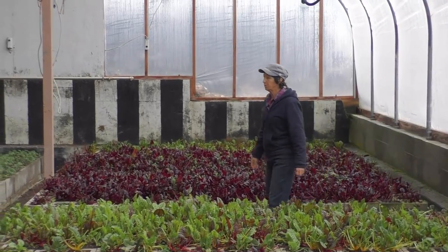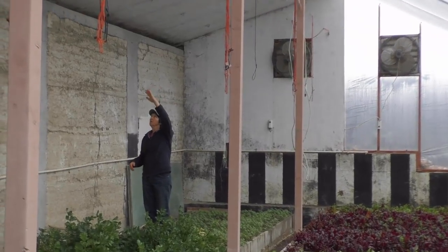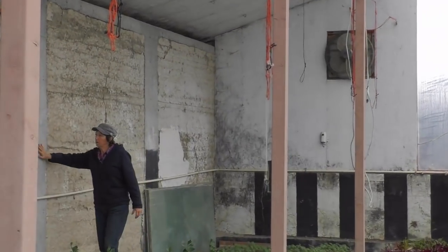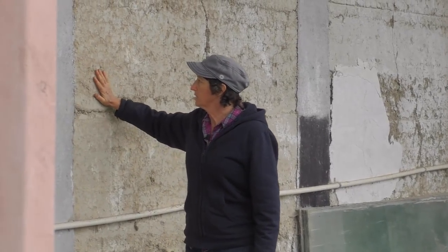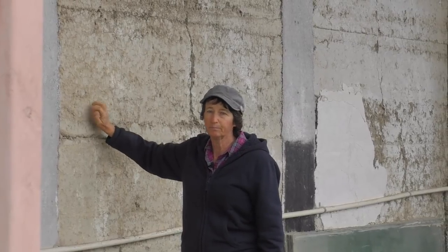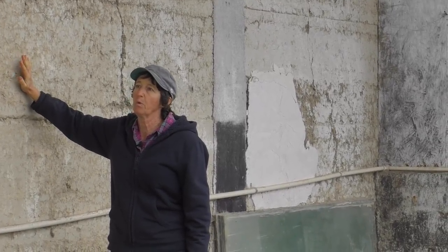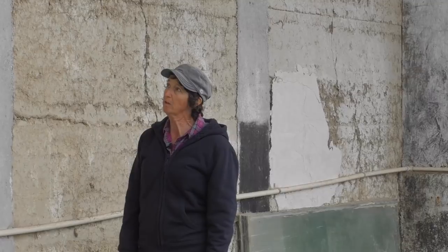I want to take you to the back half of the building — this is our north side — and this side is solid. If you look up at the roof it's insulated just like a house, with insulation and tin on the outside, so it doesn't let any light or cold in. This wall here is actually 16 inches thick — these are cement pillars, and then this here is rammed earth, our clay soil. It's clay soil with a little bit of cement and water, poured in two-foot lifts and compacted. This rammed earth wall's purpose is to give us mass in here and help hold the heat in, and it has done a great job.